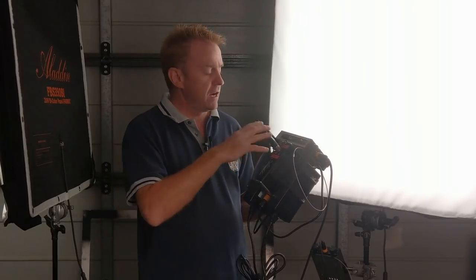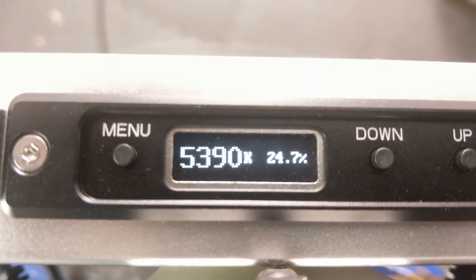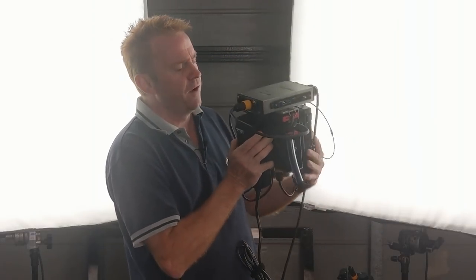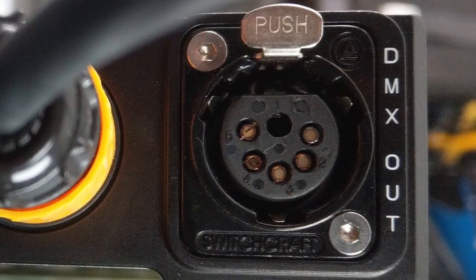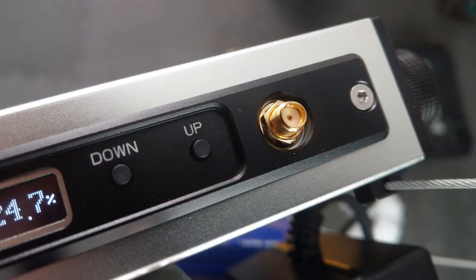The controller is very, very good. It dims in 0.1% increments, which is really handy at low levels. It's bi-color — have a look at the previous review for accuracy details on the bi-color dialing. It's extremely accurate up to about 5,800 Kelvin; above that the readings are not accurate. The controller has a nice display on the side so you can see exactly what you're dialing in — no guesswork. It also has five-pin DMX in and out on the bottom, so you can control it through a console, and it has Lumen Radio in and out so you can control it via a professional lighting app.